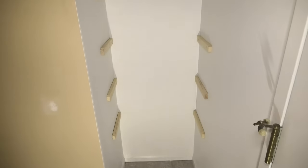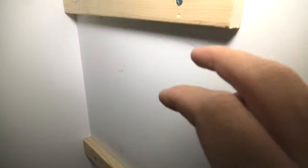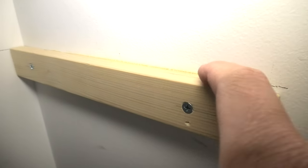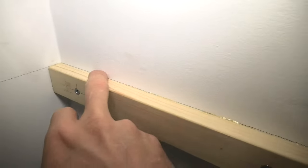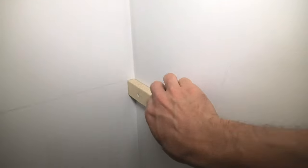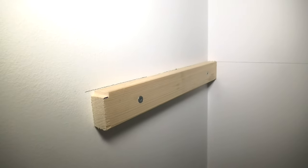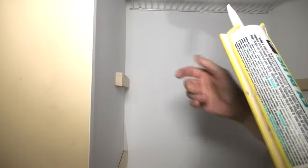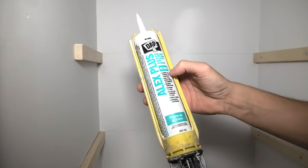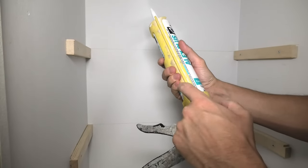Okay we have all our supports installed. The glue is now dry. I will show you how it looks. We have a little bit of glue that came out which we cleaned but only in a few spots. Other than that all of them are now secure on the wall. They are not going anywhere. The next step will be to use a caulking gun to seal all the gaps for our supports. I am using Alex Plus caulking. It should last for 40 years and this is a very good caulking gun. It is dripless.